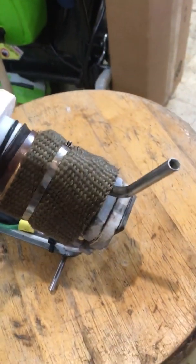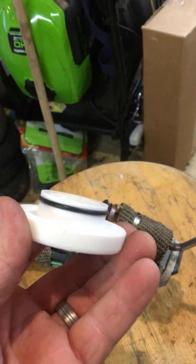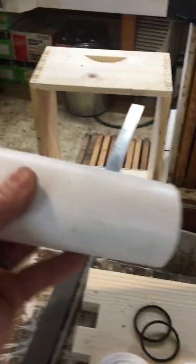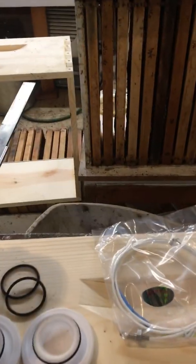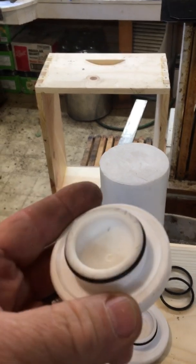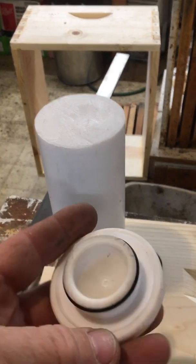To make your caps: press them in upside down and they go in there, holding the O-ring. Use high-temp Teflon O-rings — buy a one-foot section of Teflon, cut it on a lathe, bring it back down to size and measurements, then make your own Teflon caps to your specifications. The cap holds two grams of oxalic acid.